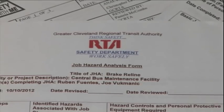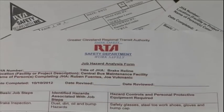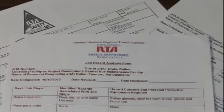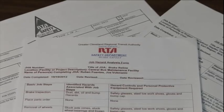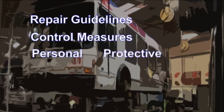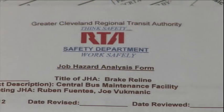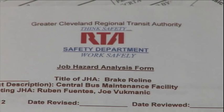The job hazard analysis, or JHA, is a tool we have to help ensure safety. A JHA identifies potential hazards or risks associated with an individual repair or procedure, and it seeks to mitigate or eliminate those hazards. It includes recommended steps and guidelines, outlines control measures, proper personal protective equipment or PPE standards, potential hazard triggers, and other cautions. A proper JHA is not just a piece of paper — it represents an ongoing process that continually evolves as working conditions change. A JHA doesn't make a job safe, but it does help everyone understand the hazards and the controls set in place to mitigate or eliminate them.